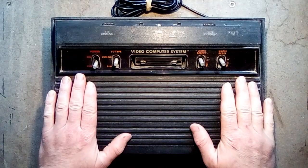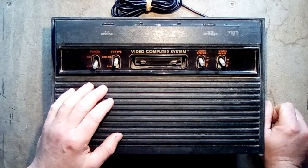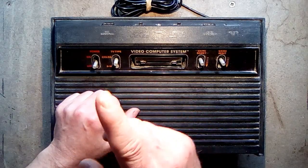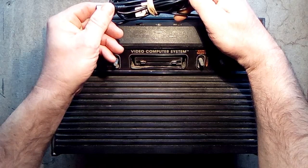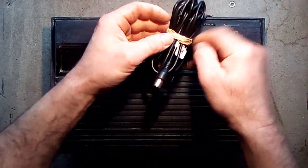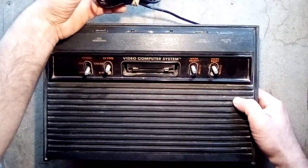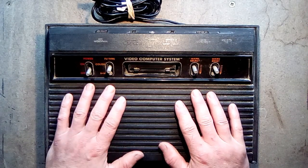So the story so far: we tried to make a power supply using a nine volt battery and a headphone jack — it didn't work. Then I dismantled that cable and plugged it into a nine volt regulated power supply, and I don't know for sure if it's powering on. I still haven't gotten any signal. But when I moved the system back over here, I noticed that this cable is frayed in a number of places. There's a big fray on the cable right here, and there's another one not too far away. It's very possible that this system is working fine, but it can't send the signal to the TV because the cable is frayed.